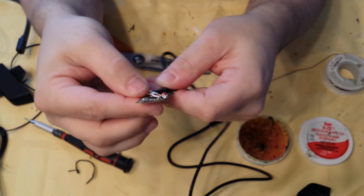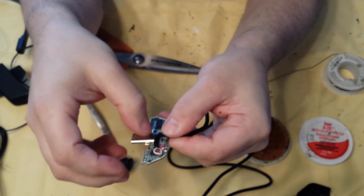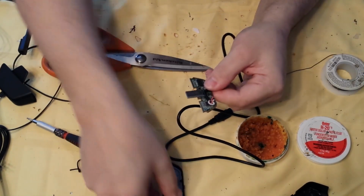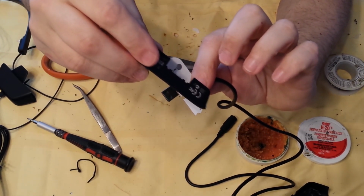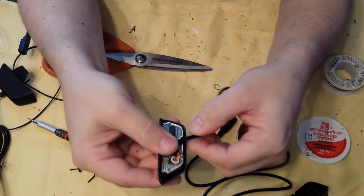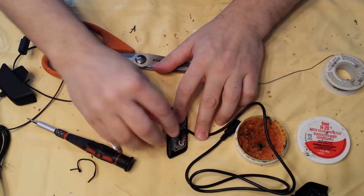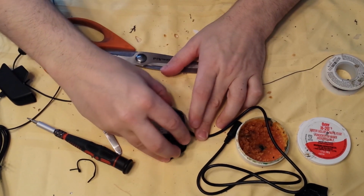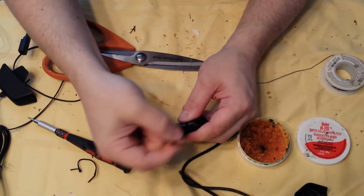There you go. Now, line your fat black part of the cable up with this connector. If you look at the bottom, this is where your mic, mute, and your volume up and down are. You want to lay that inside the case, like this. There you go. Put the cover back on. Make sure your wire comes right through the hole.